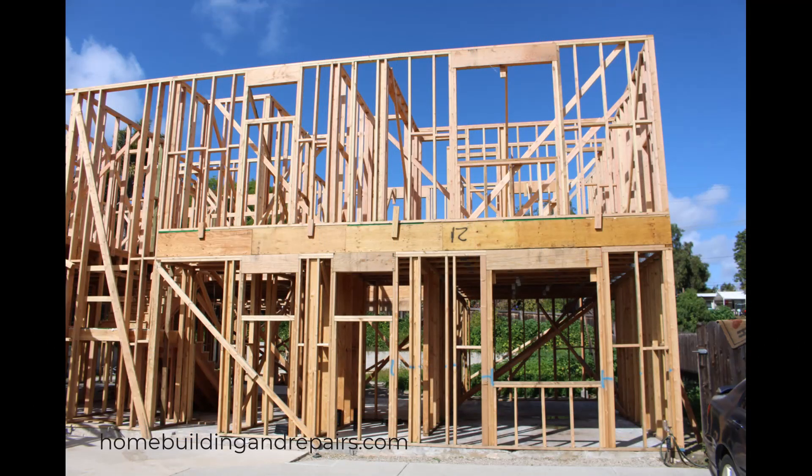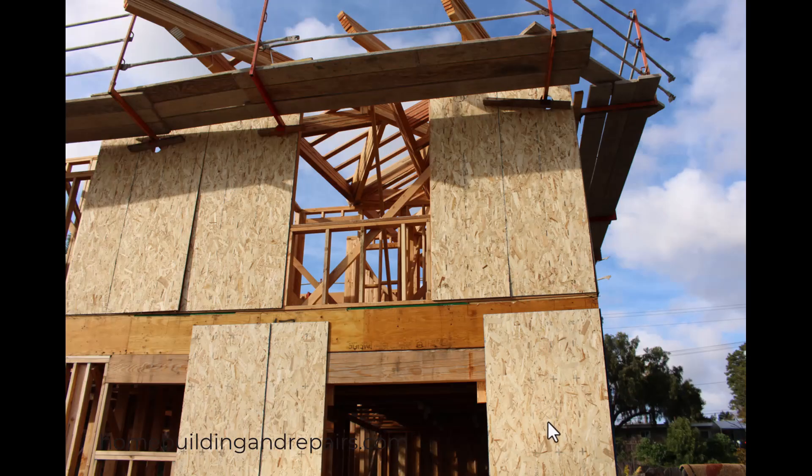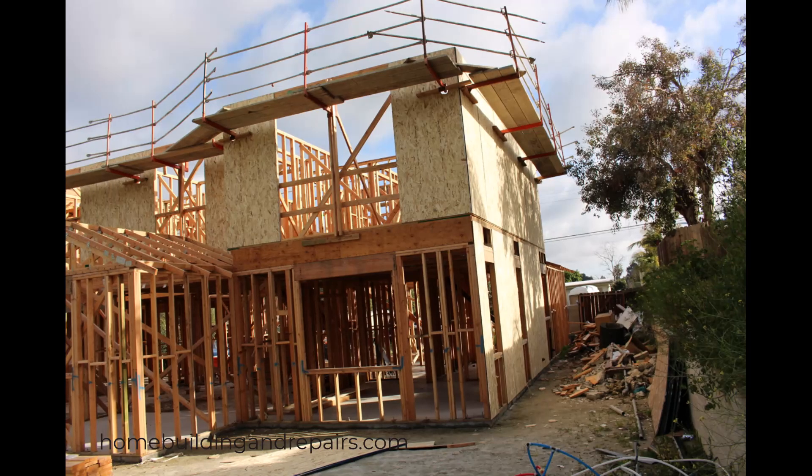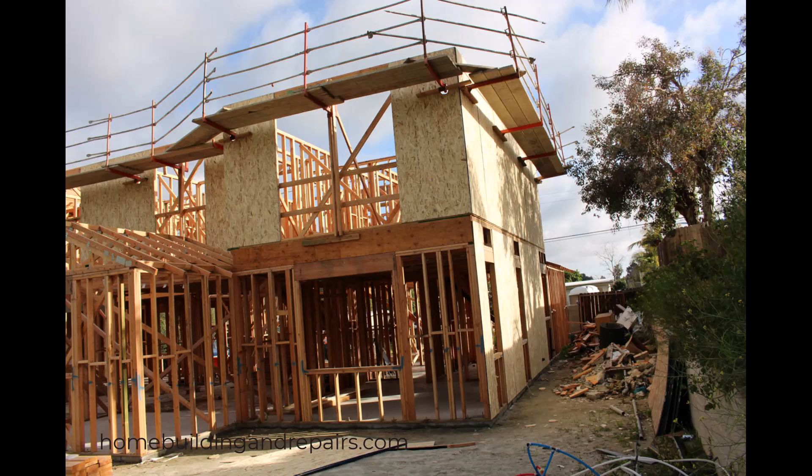Let's finish the video with a couple of examples. We have different spacing in the floor joist — I believe this was the 19.2 on-center layout. The upper and lower wall framing studs don't line up clearly. You can see that this one here lines up, but it doesn't line up over here. This is because the shear panel or wall sheathing isn't going to go all the way up. They're going to break it here on the bottom wall framing plate, and then use the rim joist over here. This isn't always the best way to do this — I would have had this tie together, and yes, it would have taken more time, but it also would have been structurally stronger.